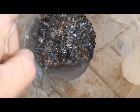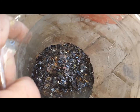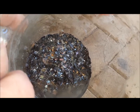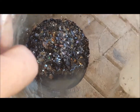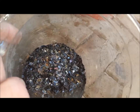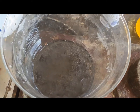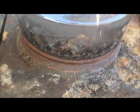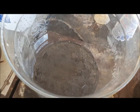Now I need to get rid of this tap water in case there's silver in there — there most likely will be silver. So I'm going to pour as much as I can out, put some distilled water in there, rinse it, pour it out — I'll do that three times in the hope that I get all the chlorinated water out, because I don't want the silver to turn into silver chloride. It's been washed three times with distilled water, pour it out each time, and now I'm going to add some nitric acid, put the lid on, and leach out any base metals.